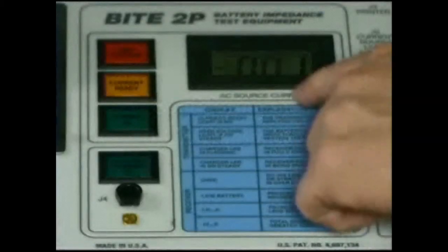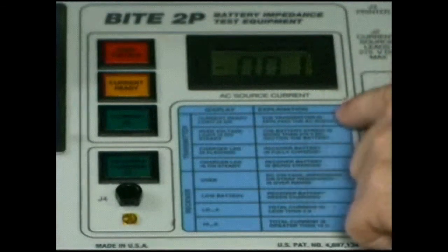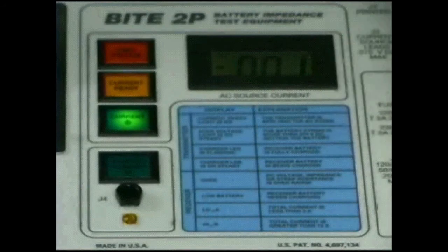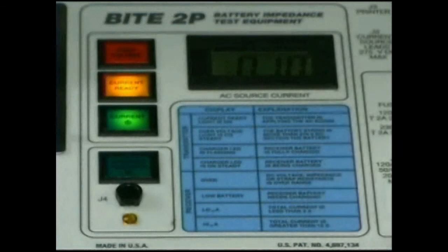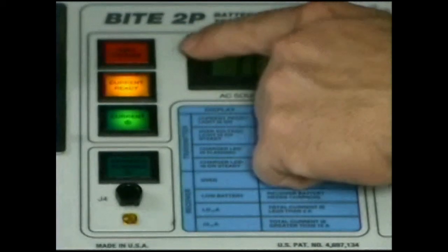When we turn the power switch on, you'll see that the LCD displays the current being applied to the battery. Right now there's zero current being applied. We'll press the current switch — that will start the current flowing to the battery, but only after the charging capacitors are charged to the bus voltage. You'll start to see that the yellow light is illuminating, and when that's finished it will read nine or ten amps as being applied to the battery. We also have an overvoltage switch, and we also have a receiver charger battery charger switch.